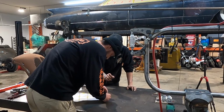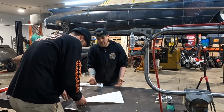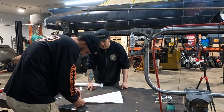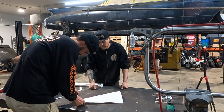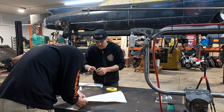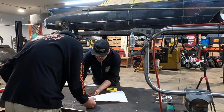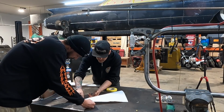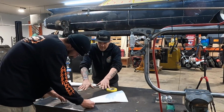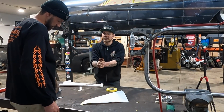Sometimes you just take a razor blade, slice it, and just let it overlap. Oh yeah. And that will show you the same thing. Like, I don't even know if you need to slice that far. Right there, maybe. Something like that. That's literally all it is. Like you almost took the wedge out of it already. And then if you were to slice right in there, you would see when you put it flat again, the wedge, and that's exactly how much material you need to shrink.